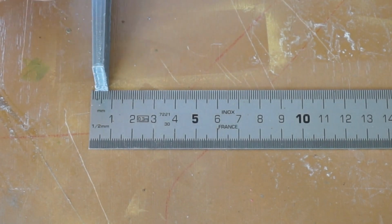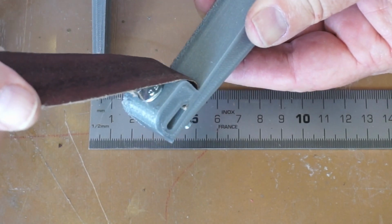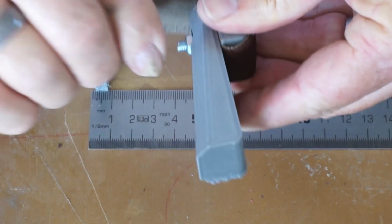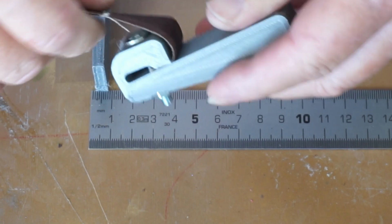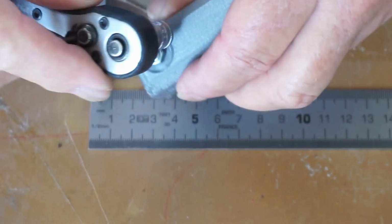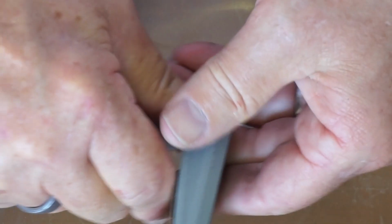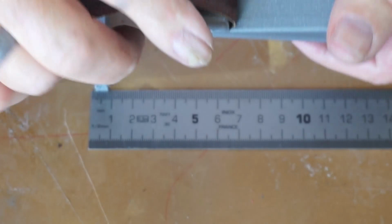Okay. The other thing I did was I printed out the clamping mechanism for the belt, and I'm using a 25mm wide belt here. And of course this will be a wing nut because it's going to be on the inside, so you can tighten it up like this. But the thing that I was worried about is if the clamping force is enough. So I clamped it. I screwed it down with a bolt. I couldn't get the right wing nut, but even when it's fairly loosely tightened, I still can't get the belt out. Okay, so that works as well.